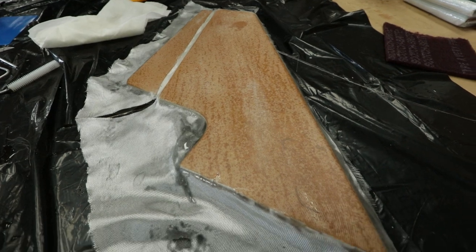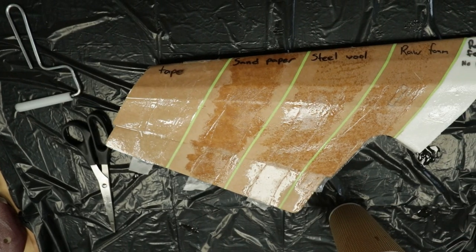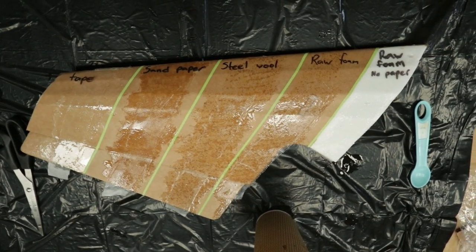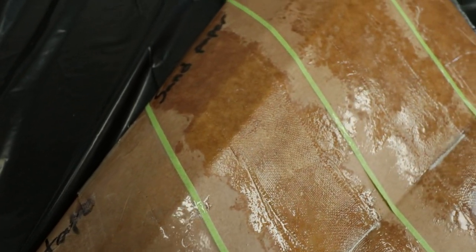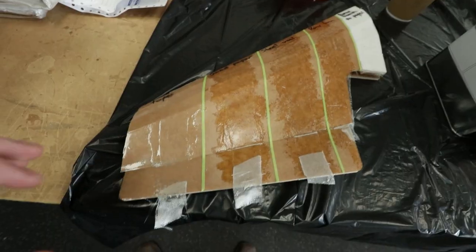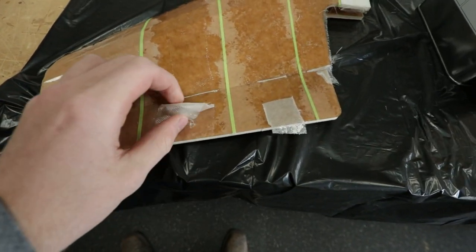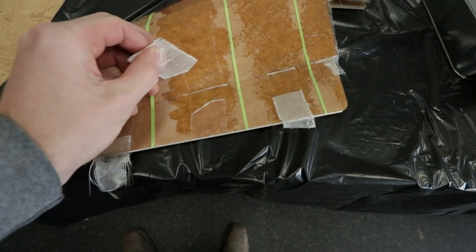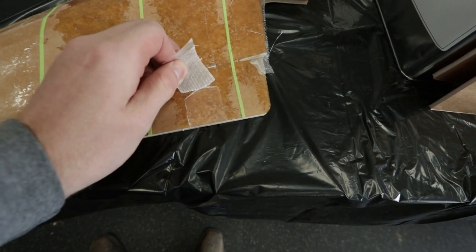Once you do that, you have a really good finished surface. They tested different surface prep methods — going from steel wool to Scotch-Brite, ultimately to sandpaper — splitting a section of wing into five sections. What they found is the coarser you scratch into the surface, the better the resin soaks in. The more resin you take off with the squeegee, the better the adhesion and the stronger everything was. The resin itself is actually really brittle, but when it gets infused with the fiberglass, it becomes rock-hard.